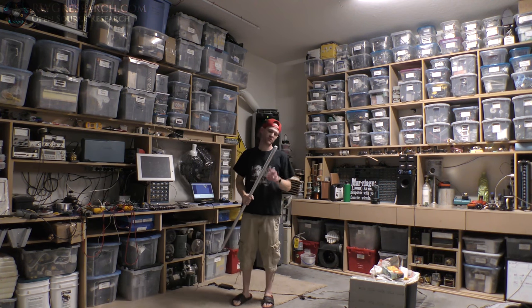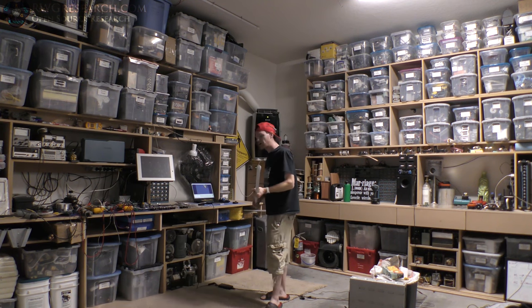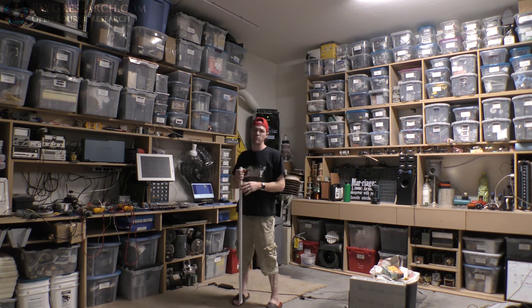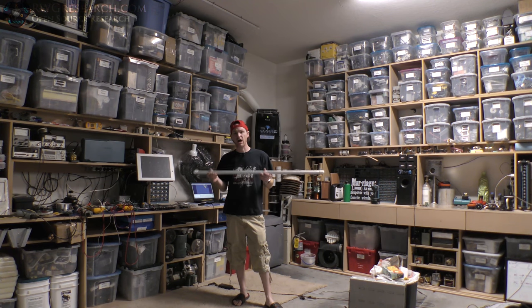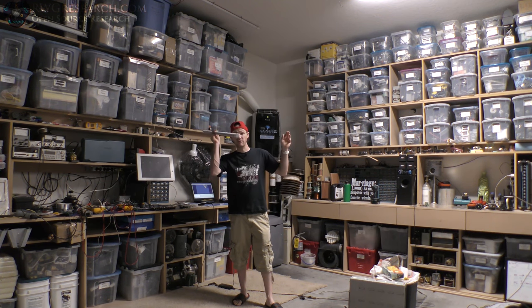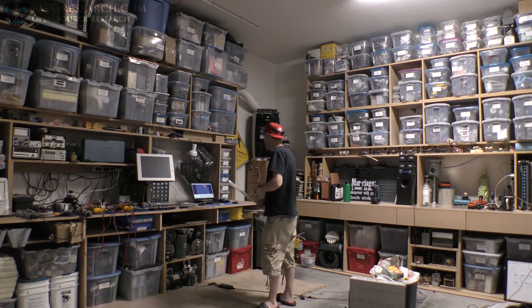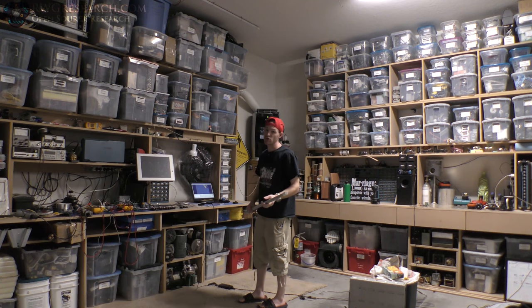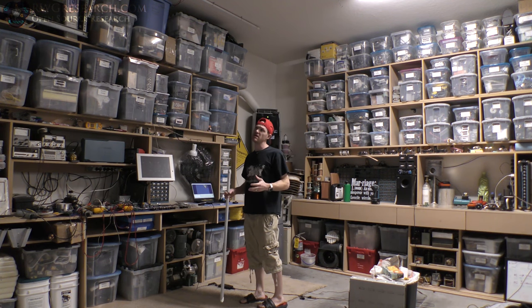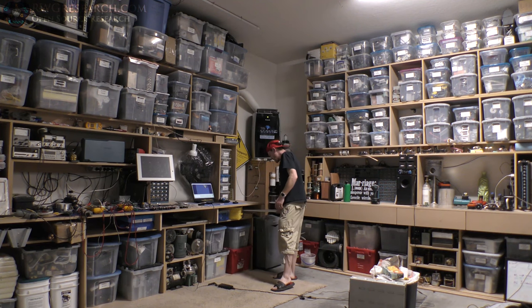It's 120 volts — I can just put 120 volts across the ends, voila, 2000 lumens of light. You can stick these anywhere you want. Realistically they're supposed to go into a fixture because you've got exposed pins, but you can rewire them. Most of these require you to either have a ballast or not — they're mixed right now. However this one is 120 volt direct; you cannot run it with a ballast. I ran around town and found a really good deal — a whole box of 16 was about $40, just over two and a half bucks a piece.